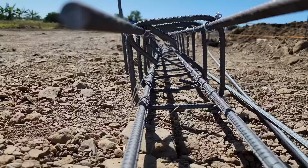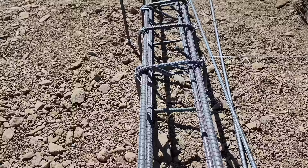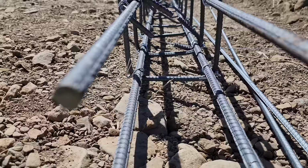As you guys look down the center of this column, I told you guys yesterday, for some of you that aren't familiar with building here in the Philippines, a lot of expats that maybe don't know, one of the things to watch out for when you're building your house, I talked to you about the 135 going into the concrete for shear strength. Today I'm going to talk to you about making sure that your workers are alternating that 135 every other, and you can't all be on the same side. You've got to alternate those. So as you look down that column, they're all alternating.